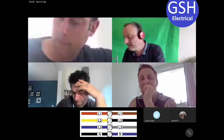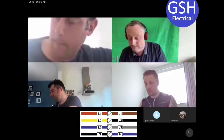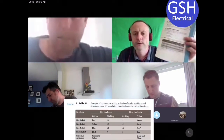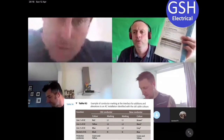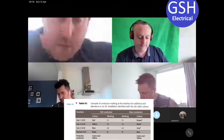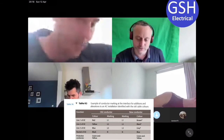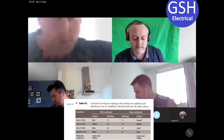So let's look in the on-site guide again. We need to look at the very back. We're in Appendix K. What did I say H for? And we're on page 203, right at the bottom. Happy with that? All got that? Yep. So you can see there, now all of a sudden, once we're interfacing our 3-phase colours, old and new, we must mark them. Red as L1, yellow as L2, blue as L3, black as neutral. If you look across the other side, we've got brown, black, grey, L1, L2, L3, and blue as neutral.